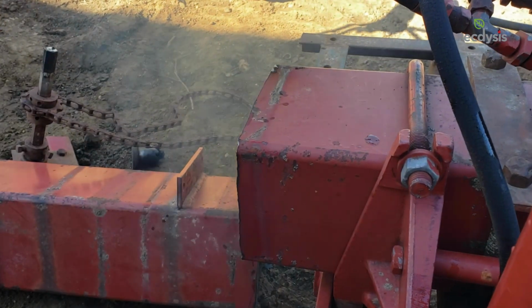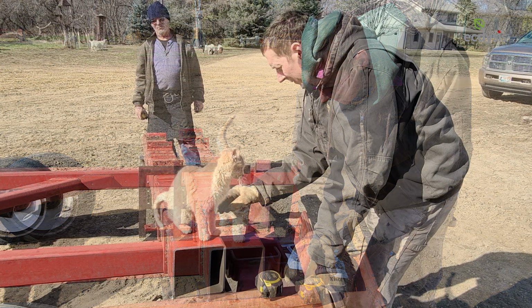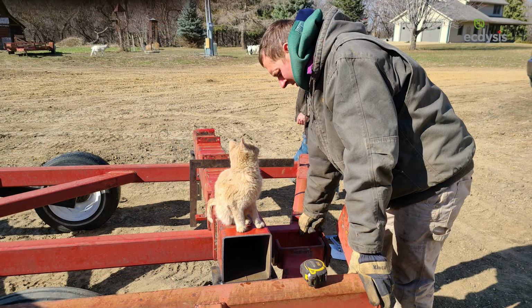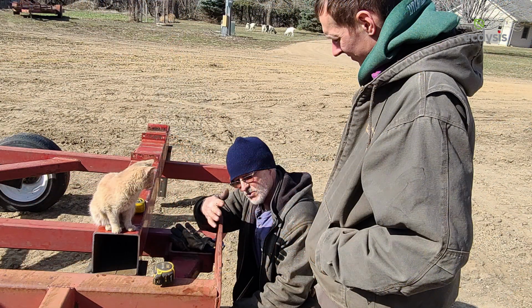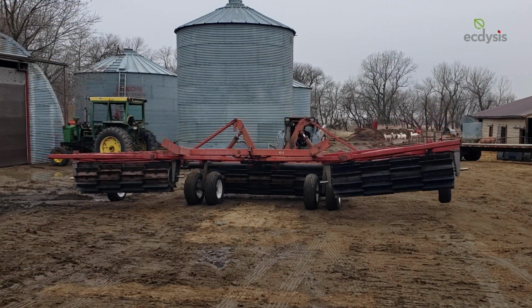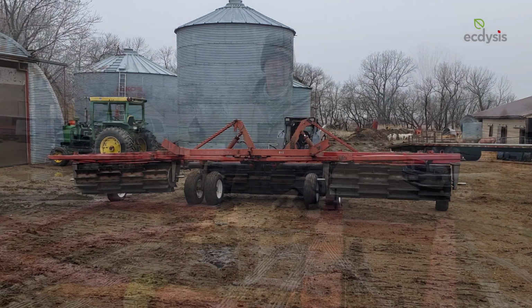The toolbar needs to be positioned on the wing so that the wing drums overlap the center drum by 2 inches to ensure complete crimping, while also ensuring the wing drums will be able to fold up and down without scraping on the ground. Additionally, make sure the wing drums do not hinder movement of the running gear. Take your time and consider the full range of the running gear and the distance your wing drum will hang down. Here's Mike to explain this particular feature of the build further.